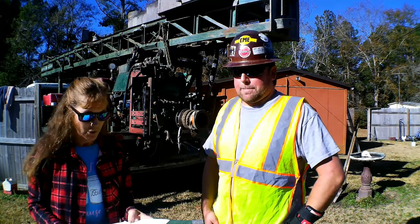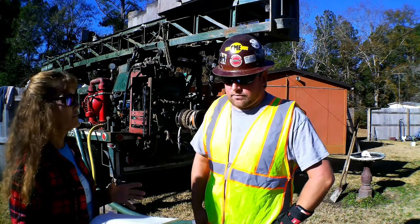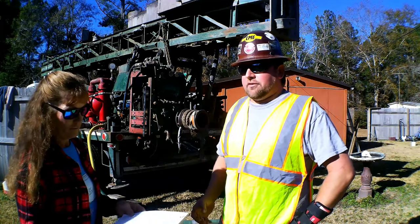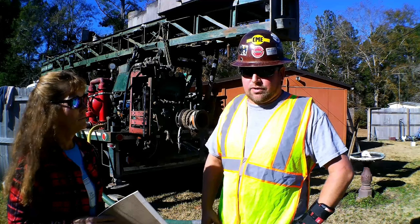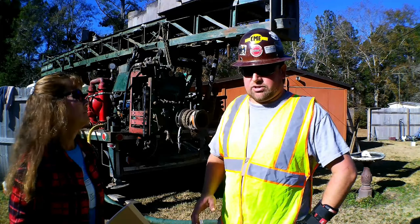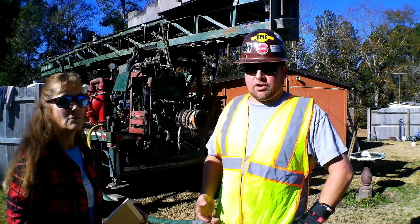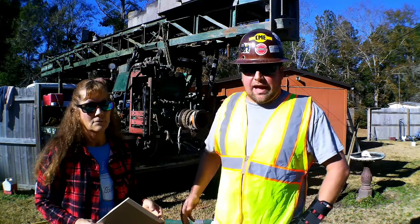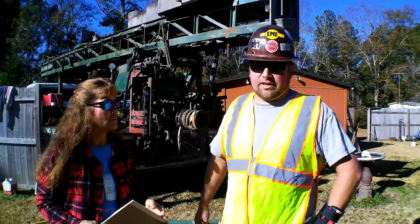This is so informative. So what does it mean when the drill drops in the ground, just like drops? Depending on where you're drilling, there are different scenarios here. Like I was just saying, in this region on the coast, we have a lot of voids or caverns in the limestone rock, and sometimes the drill will not drop at all. We'll stay on hard drilling material, but we will lose all of our fluid that we are recirculating, because mud rotary drilling, which we're doing today, recirculates. We pump our fluid out of a mud pan and back down the drill rods, and that flushes up all of our cuttings into our mud trough.